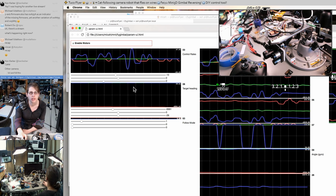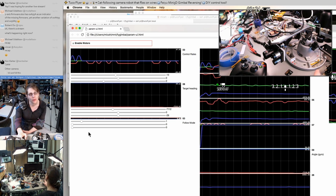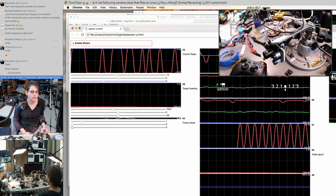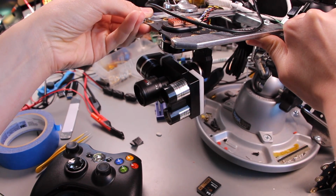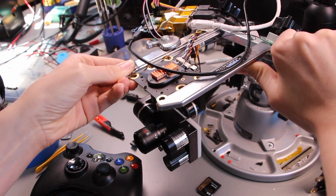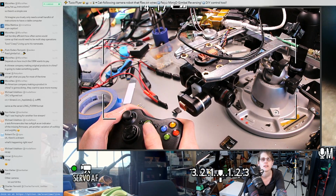So I took a little closer look at that, and it seems like there are 2 different versions of this control loop that are selected between, depending on whether or not you have this follow mode on or off. Both are actually setting this control rate, they just do it in different ways. But then this one should be the follow mode for pitch, which selects between those 2 different loops. So the effect of that is to hold it at a level horizon. And it does so pretty much immediately, like it isn't trying to approach it with a very slow motion, it just goes straight to that. So this is just trying to be subtle about it, but it can also go fast.